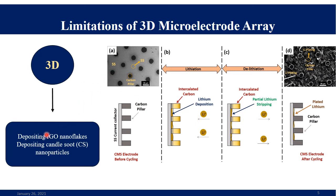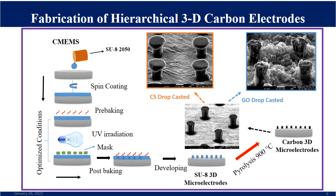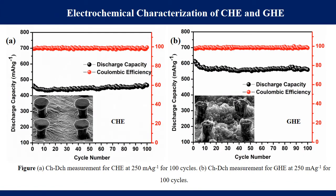To fill the gaps between the carbon microelectrodes, we chose RGO and candle soot. Following the same fabrication process up to the carbon micropillar stage, we then drop-cast candle soot and RGO separately onto the carbon microelectrodes, giving rise to hierarchical structures. The charge-discharge stability plots show coulombic efficiencies near 100% for both electrodes — a significant improvement over the bare 3D carbon microelectrodes on stainless steel.